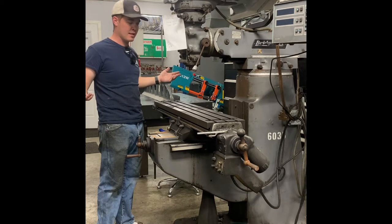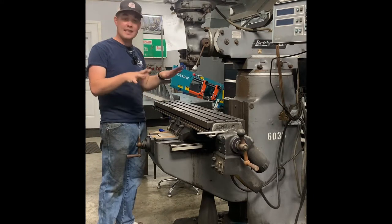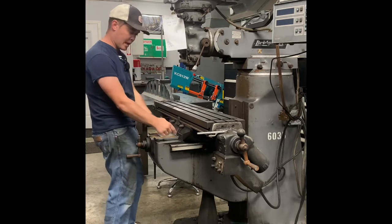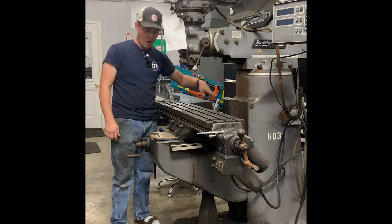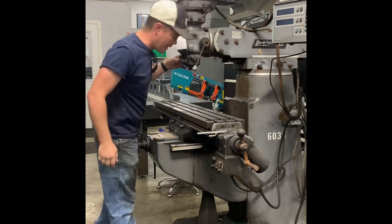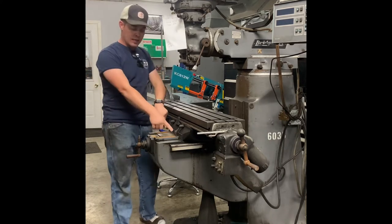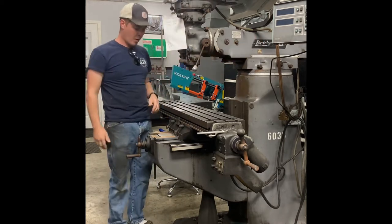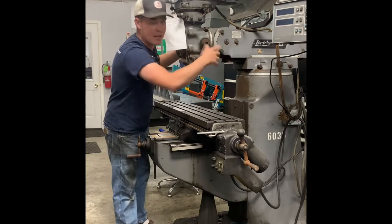Typically you can find these machines for anywhere from $2,000 to $4,000. I picked this one specifically because it's a later model. In 1983-1984, they changed the model of these machines — they put a double gib lock on the front and a double gib lock down the side on the knee. There's also a plastic Bridgeport tag here as opposed to one cast into the ram. You've got to be careful when looking for a late model Bridgeport because sometimes people will scab them together — you'll see a double gib lock but a different ram with the casting. You don't want that. You want something that's original.